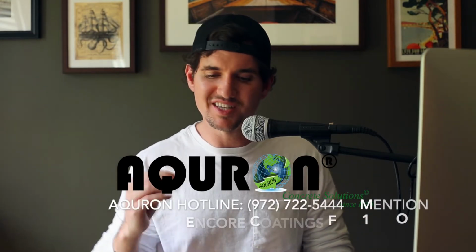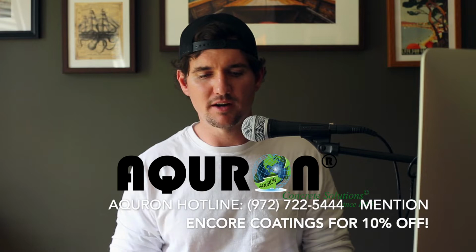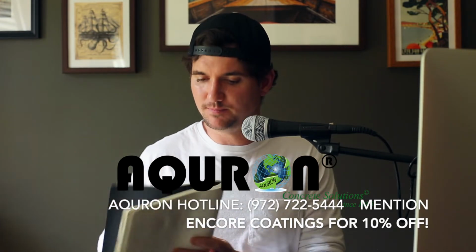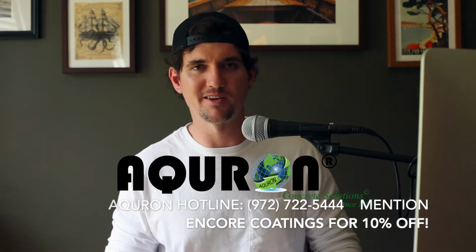Coatings 101, okay? Even if you use Triple Crown, even if you follow our protocol and you pressure wash it and all that stuff, if you have bad concrete, all you're doing is cleaning bad concrete. That problem will persist even after all of those measures you take, okay? So a densifier, it's awesome technology. Go watch my bad concrete video to learn more about that. But please inspect your concrete. If you have bare concrete, doesn't matter how old it is, inspect it, please.